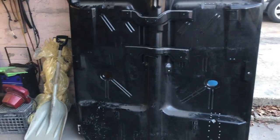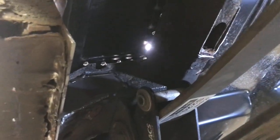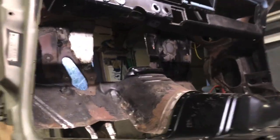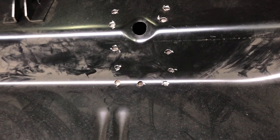Get ready to put this floor back in there now, see where it's going to sit with the tubing in place, so we can see where we're bending the tubing next. Check it out — there's your beautiful floor, man. All the holes line up with everything. Perfect. We'll weld all that stuff together now — all these in the front. We're going to get the bar in here now. Nice and tight. Got all the weld spots, all the plug welds — even against here. Look at how nice and tight all that is.